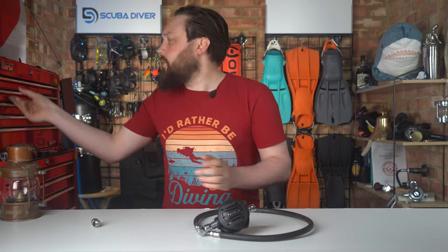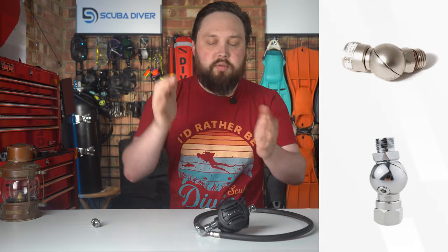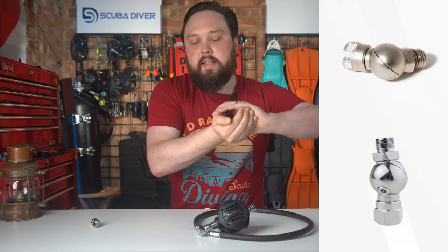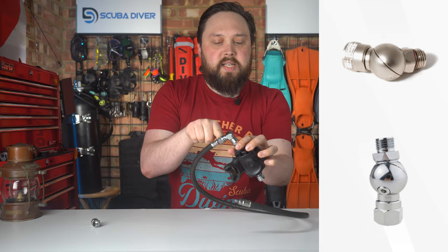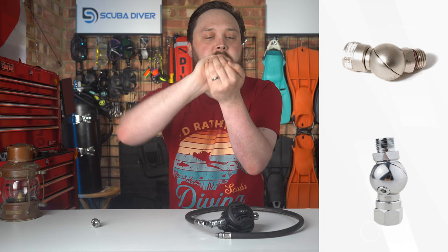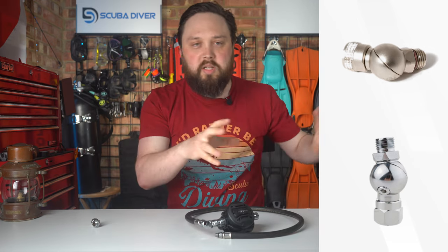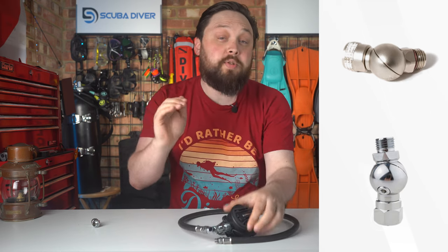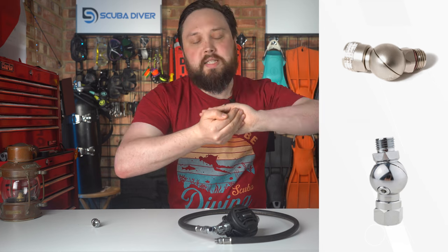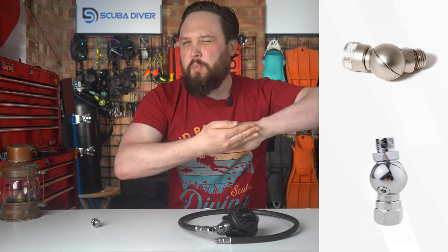When you add a swivel joint — and I don't think I actually have one to show — swivel joints are in most circumstances two like hemispheres. It's very similar to the elbow setup, except there's basically a separation in the elbow part. Because there are two hemispheres, as they rotate the hoses can change to whatever angle. And because there are two separate parts, you have an extra O-ring in the middle to create that sealing surface. Unfortunately, that's a dynamic O-ring — dynamic just means something is moving on it — and the problem is you've got a higher risk of it wearing, but also extruding.